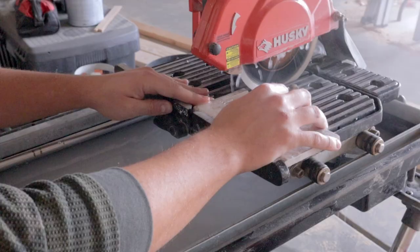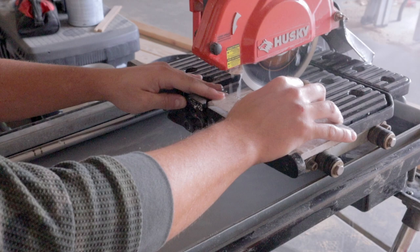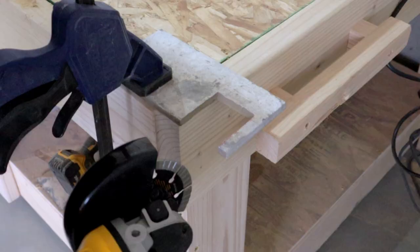This way I'm not going out into the cold so many times to cut on my wet saw. Using the wet saw with a fresh blade makes these cuts super easy. For cuts really close to the edge, I go really slow hoping I don't break it off — it can make a tile job look really amateur if you break this piece and just stick it on anyway. I also have a stone cutting blade on my angle grinder to clean up the edge.